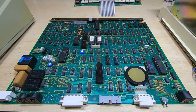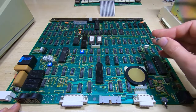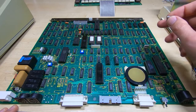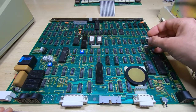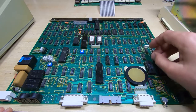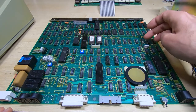The other thing I've done is pop the crystal out and fit sockets onto the board. I'll be using the Fluke to do some testing and it won't run reliably with the 12 MHz crystal fitted, so I normally put a 10 MHz crystal in — it works fine. The sockets are just a couple of turn pins from an IC dual socket; they have a nice sprung contact and are just the right size for the crystal. When the board is repaired, I'll remove the connector and solder the crystal back in.